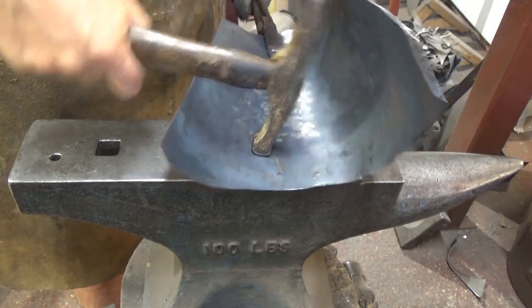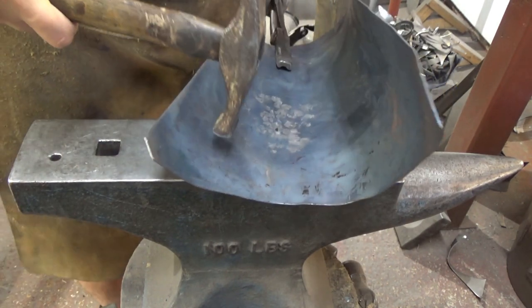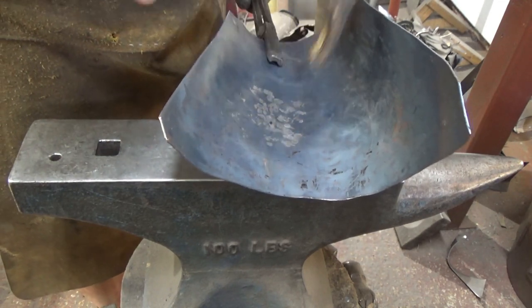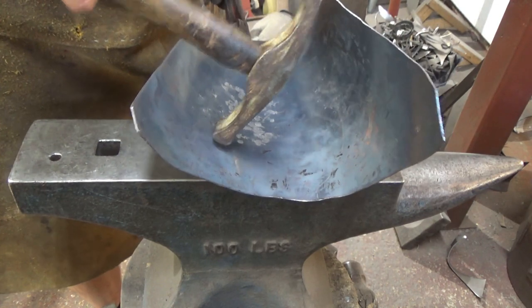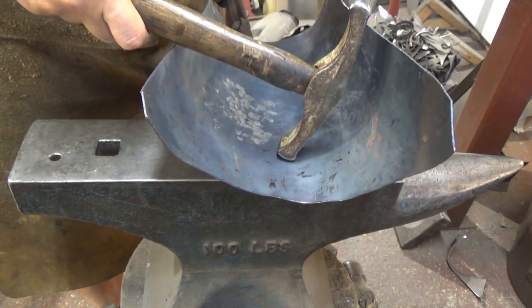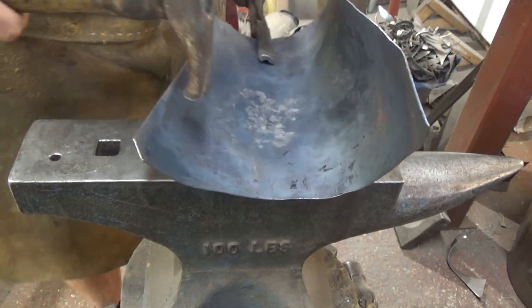You see, occasionally if I miss blow, I'll just pull it straight down to the anvil. That'd be a wasted movement. But because it's a nice bit of mild, I tend to be able to get away with it. And if you heat too much material as well, it's worth, for instance, this was red hot and that's red hot, and I'm striking here, what I'll probably be doing is pushing that anvil shape into this space. So you need to be careful of your heat as well.